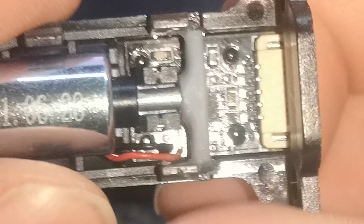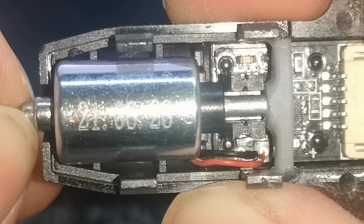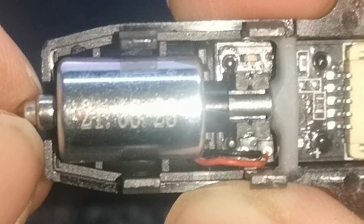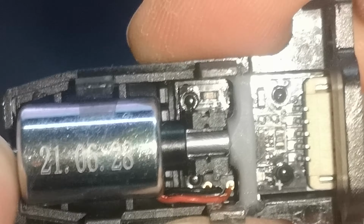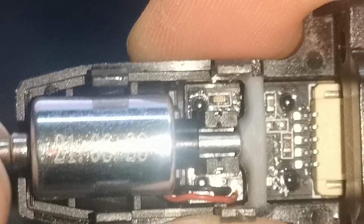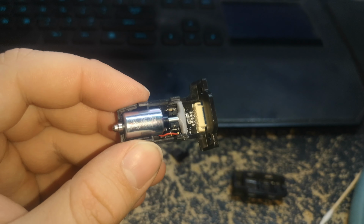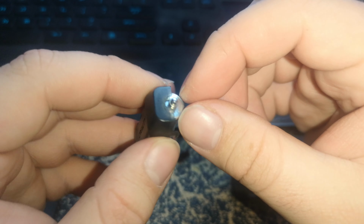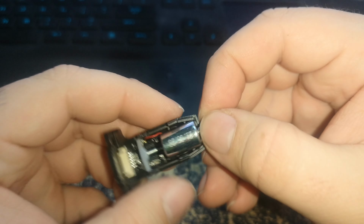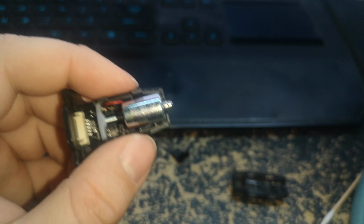If we zoom in, I'm wiggling the tip of it, and before it used to have a whole lot of motion, and it doesn't now. And it has no resistance, because if you have a human hair's worth of resistance in here, it doesn't deploy. But that basically holds it. So the back side of the pin is secured with this bracket. The front side, however, is still loose, free to move around, and that's where the rattling is coming from.